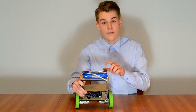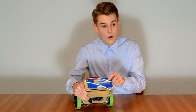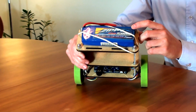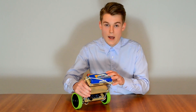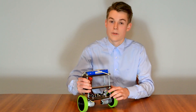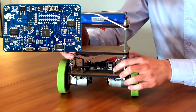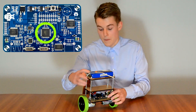At the top, we have a 3S 11.1-volt LiPo battery that is connected to the main board and drives the motors. The weight of the LiPo battery is also used as a counterweight for the robot to keep it balanced. At the bottom layer, we have the main board — the Arduino-compatible controller board that consists of an Atmega 644 microprocessor.